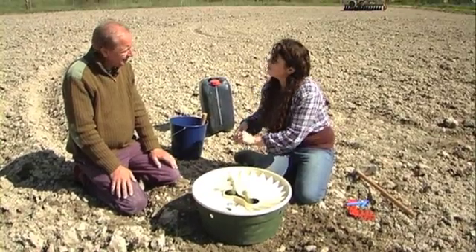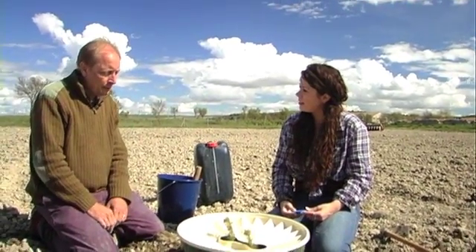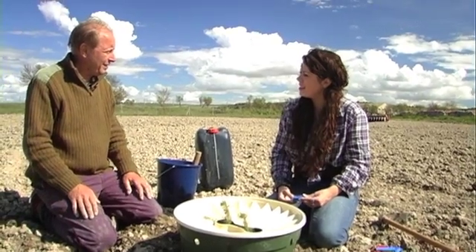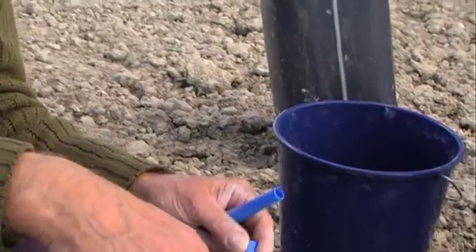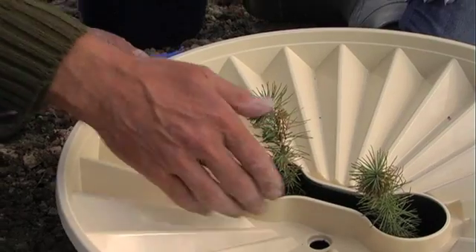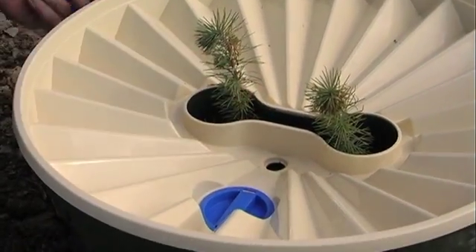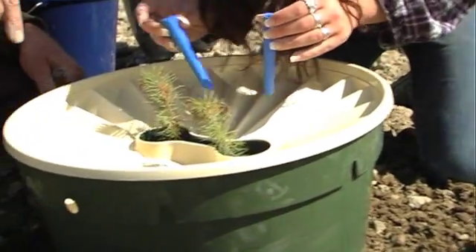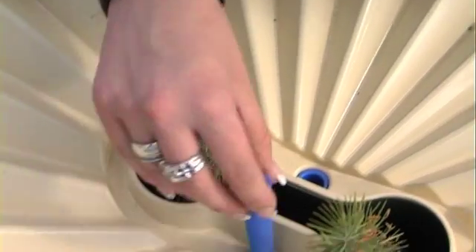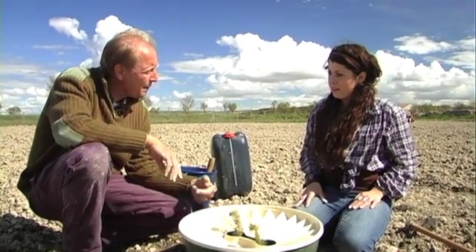Do you know why we have that cap? I have no clue. Well, suppose you have problems and there's never any rain at all — then you can use it as a refill, just for security reasons. Every morning you have condensation, and the condensation comes into these openings. But if it's just an opening it would evaporate during the day, because the box gets warm. This siphon prevents the water, once it gets into the box, from evaporating.